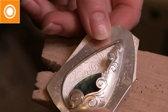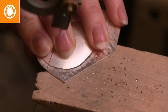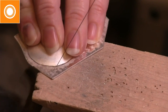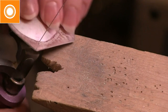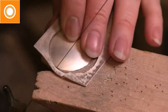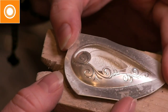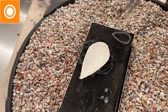This is now the back plate — forming it is the same process as forming the front. Now here I make a mistake: I cut all the way down to the shape itself, and then realized I needed to stay out a little bit. I actually want to leave a little bit of excess material. By leaving some excess material when I weld, it gives me some metal to actually weld together. So I leave a little bit of a flange. Now I need to solder in my bezel.